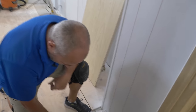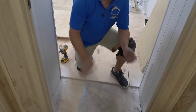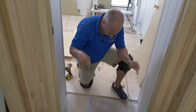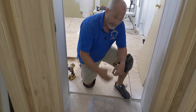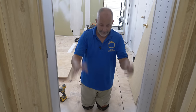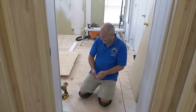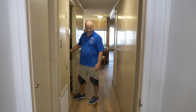There are two things to prep. I'm trying to bring the subfloor from here — there's a joist here marked with a red line — but I don't know where the next one is; it's underneath that flooring somewhere. I can't install flooring in this room unless I have subfloor through the door, and I don't want a weak spot by stopping in the middle of the original subfloor where there's no joist. So I actually have to remove the flooring in the hallway.